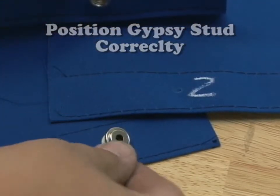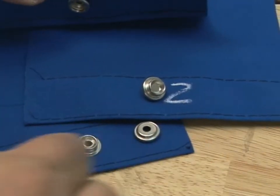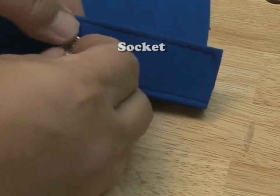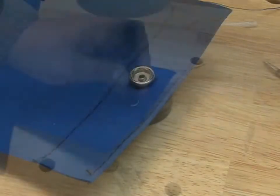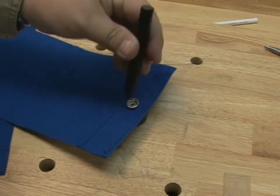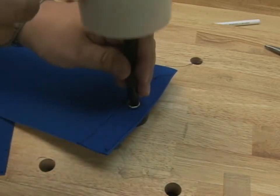Make sure that you position the gypsy snap correctly — think this through. You don't want the gypsy snap backwards for your panel installation. Once you've figured that out, insert the gypsy snap barrel into the hole that you've created and then place the socket on the backside. For this installation, we're going to roll this panel around so that the gypsy stud is facing the deluxe installation tool anvil. It will not fit securely, but this is all that's necessary to roll that rivet over. Do this carefully, otherwise you may smash the stud side of the gypsy stud — make sure your blows are gentle and soft until that rivet is rolled over nicely on top of the socket.